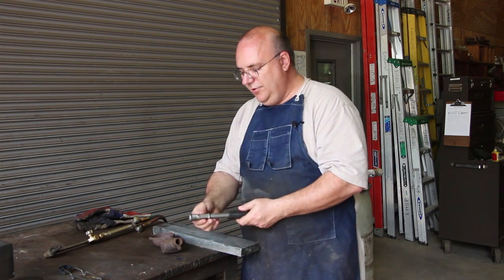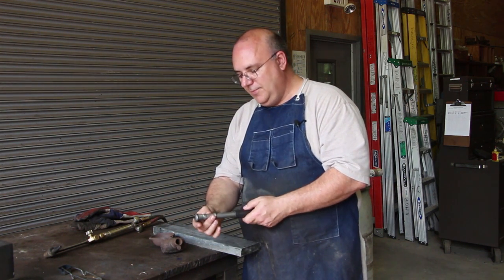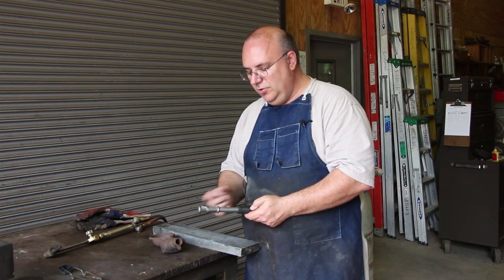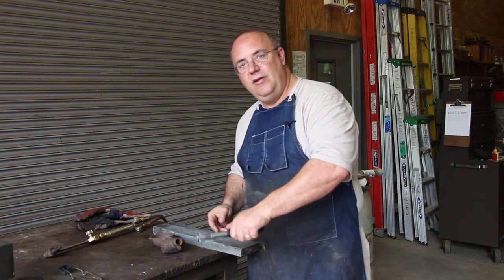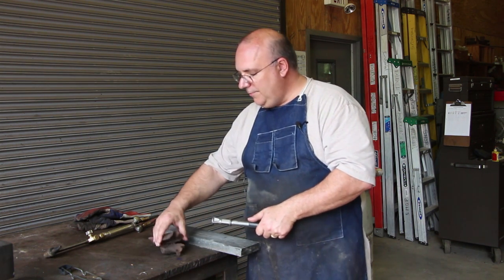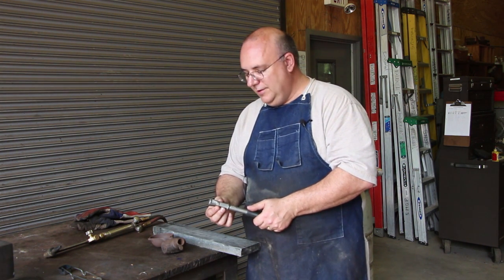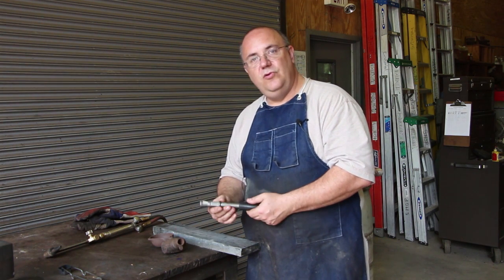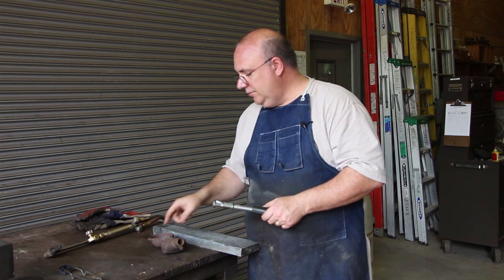Also, if you look on this one, you have a diamond shape or square shape here. It'd be diamond shaped the way it goes into the mold recess here. And when you get the molds from Cook, I think that they're actually diamond shaped so that it fits in the mold. It can't turn. It positions it, whereas my mold is round. But like I said, it's just a little bit oversized round. I'm just going to hit it on the grinder, grind that down and get it where it fits this real well. And we're going to cast us a handle using this little hammer mold.